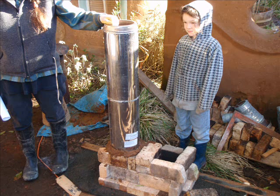These are dry stacked fire bricks. We started without the metal tube. We built a fire on the right side — the fire and smoke went straight up, just as you'd expect. The metal tube is insulated, and when we added the metal tube with warmed insides, it would draw air up so strongly that the flame and smoke would no longer come up on the right side.